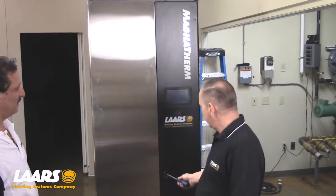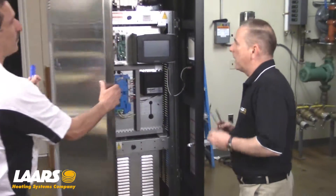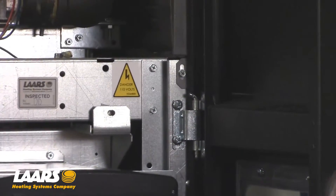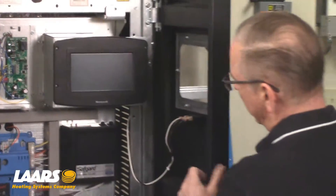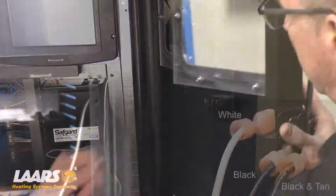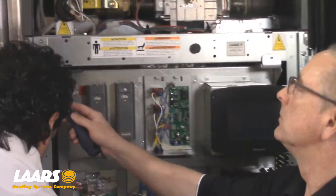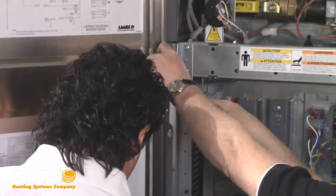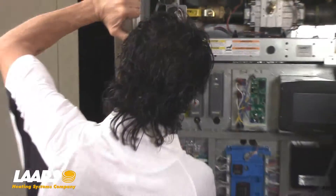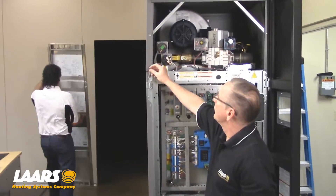To start, we're going to take the two doors off simply by putting a flathead screwdriver in, loosening up, and opening the doors. We have pins that hold the doors in position. However, on the right-hand door, there is a toggle on-off switch. We need to disconnect the switch. Now we can start by removing the pins — I'll start with the left-hand door. The pins slide out of position, and I'll put them back in so we don't lose them.